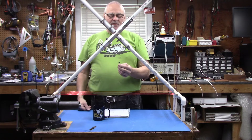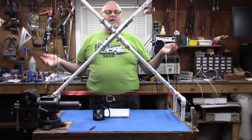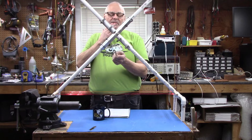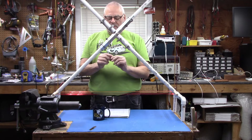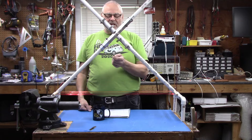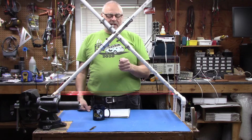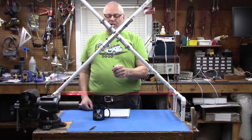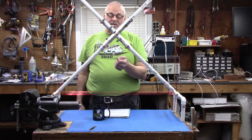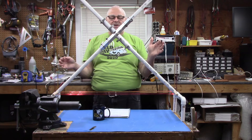The reason why you can't is: look at the area. Let's say this loop is about one square meter of area. This small inductor is about a quarter of an inch — maybe 6 millimeters — so it's very small, about the size of the head of a pencil. But they're both 500 microhenries plus or minus. This is one of those cases where size matters.